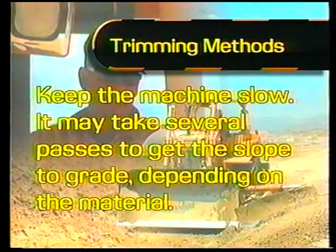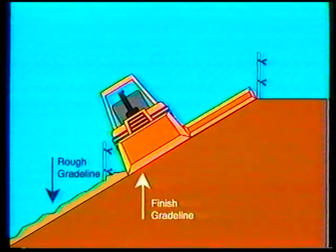that's being worked. During this process, the dozer blade may fill up with material. If so, turn the machine downhill and lose the excess material. Back up to where you left off and begin again. Return to the starting end of the slope. Move down one equipment width and repeat the previous step. It may be necessary to take out the first stake row.